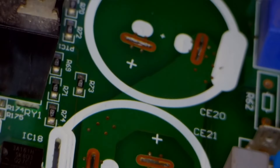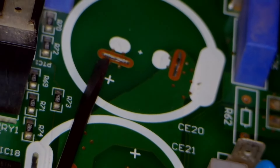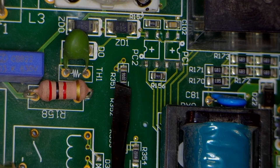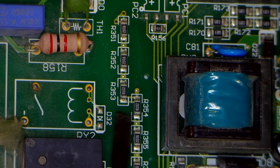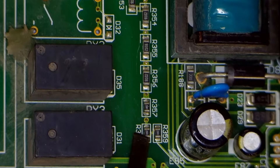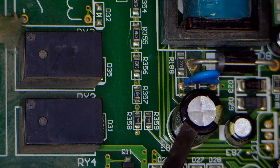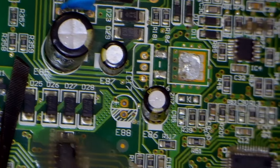As I turn it, you can see that the positive side of the capacitor is connected here. On this side, there are resistors connected — these are 91 kΩ resistors, and all these resistors are connected in series. There are 9 resistors in total connected in series, and from here they move further into the system.